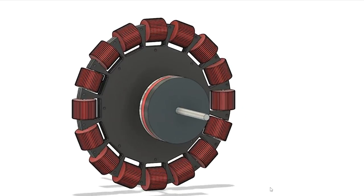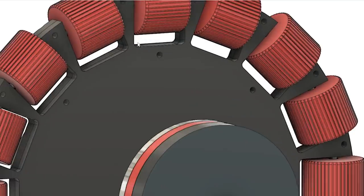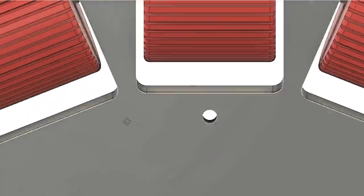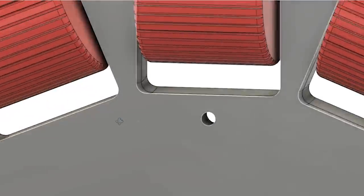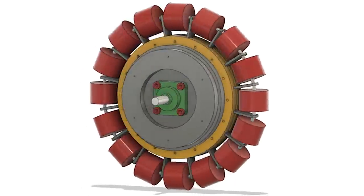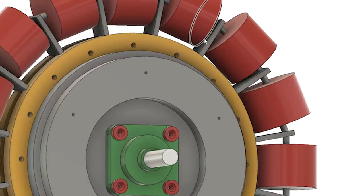One of the issues I've come across with making my own omni-wheels is that due to the small wheels facing outward, this leaves a pinch point where the hub design needs to get quite thin to fit between the wheels. So to make sure that my hub is strong enough in this design, I'm going to make the spokes out of steel.